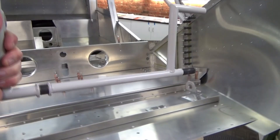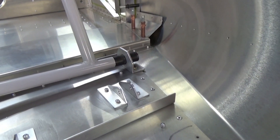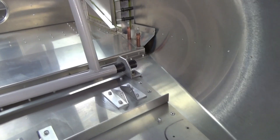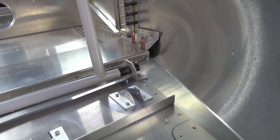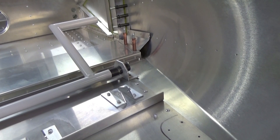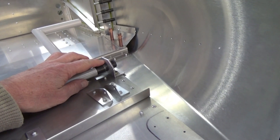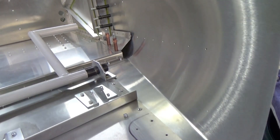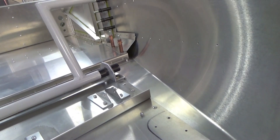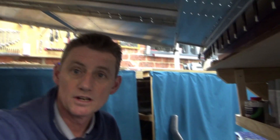One thing I have is the rudder pedals. The rudder pedal uses a steel rod into a 20mm hole as the pivot — it's just metal on aluminium. I think we can do that better somehow; might run some Teflon or even just a Teflon bearing in there, or get a proper ball bearing, make it ball-raced. It just seems a bit home-built for that part, but apart from that it's going well.